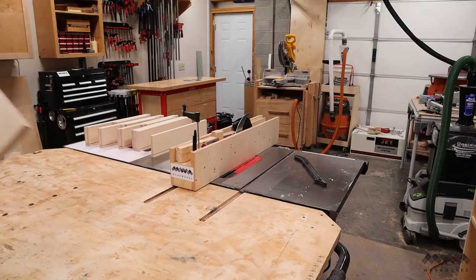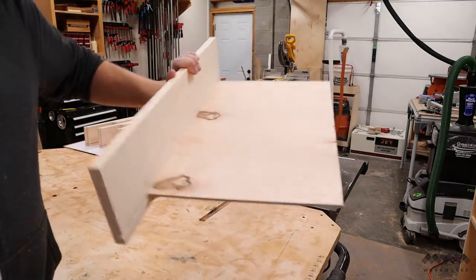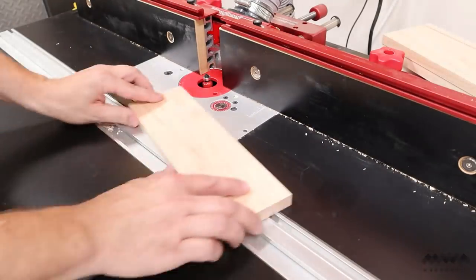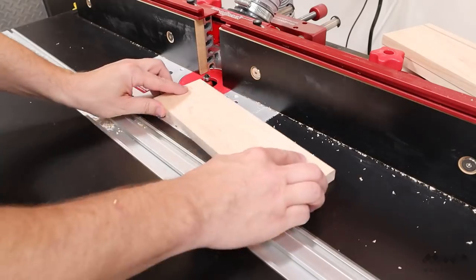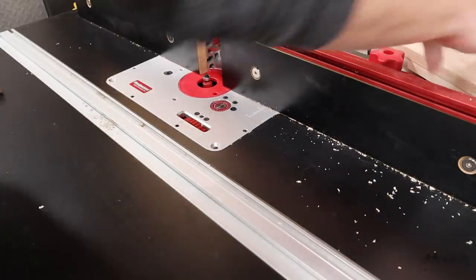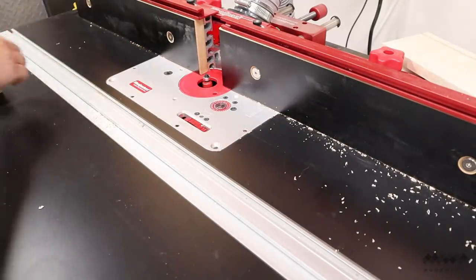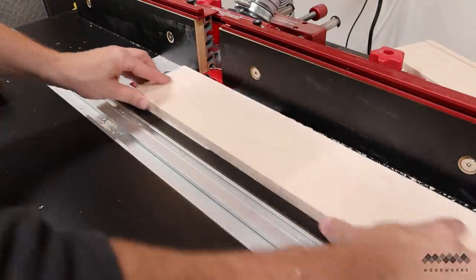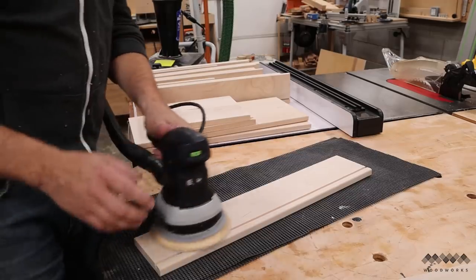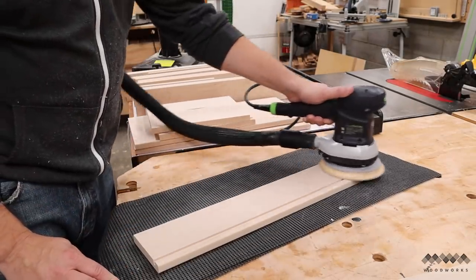As you can see, I've got a fit that isn't too tight, but the plywood does stay in place when you hold it like this. Because these are kitchen cabinets and people are going to be in and out of these drawers all the time, I like to put a small roundover on top of all the drawer parts, which is going to protect people from getting little scrapes and cuts on their hands. This is especially true with hard maple because these edges are notoriously sharp. Now I just need to sand all these parts smooth before it's off to the finishing room.